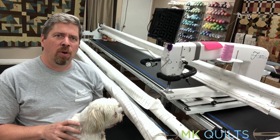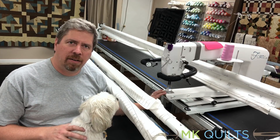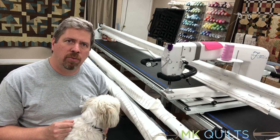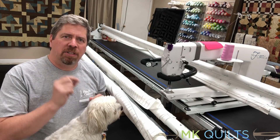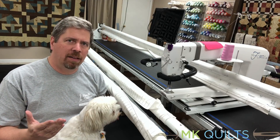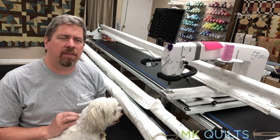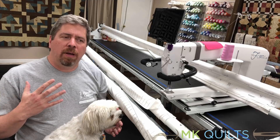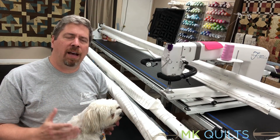What we're going to do is open up the front of the machine to get down to your hook and basket. We're going to use some tools, which I'll show you in a moment, to precisely test your timing. Bad timing can lead to bad stitches, and how often do we have tension issues and other things that might cause problems. So it's to everybody's advantage to be able to look at and test their timing.